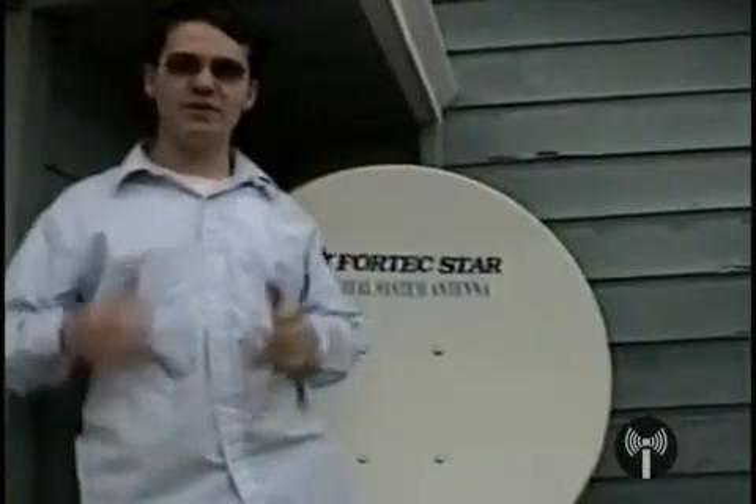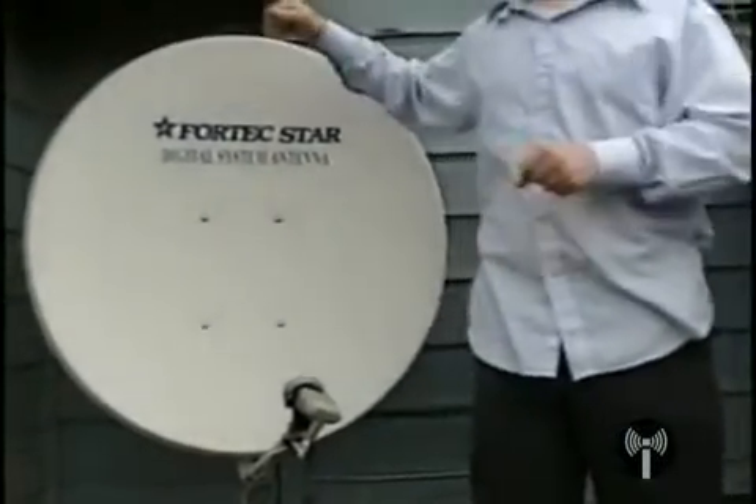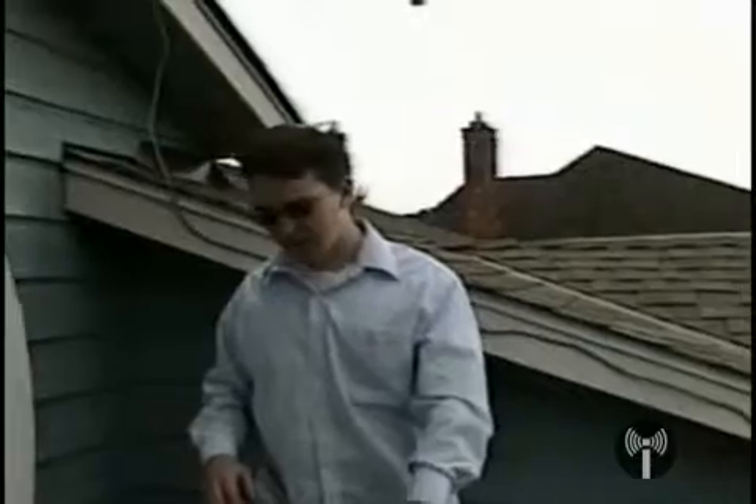The second angle is called the azimuth angle — that's what direction the dish has to face. There are bolts at the back of your dish that you can loosen, allowing you to turn the dish left or right to aim at a particular satellite. Use a compass to get a general bearing, then have someone at the receiver watching signal strength while someone else fine-tunes the aim on the roof. The last angle, of significantly less importance for a single-dish system, is called the skew — it indicates the direction the LNB is turned. You can rotate it clockwise and counterclockwise for fine-tuning. Once you've maximized signal by adjusting elevation and azimuth, turning the LNB slightly can help bring in the strongest picture.